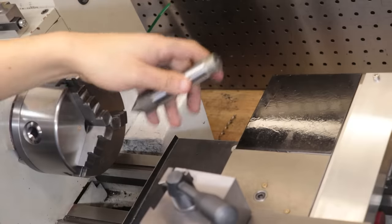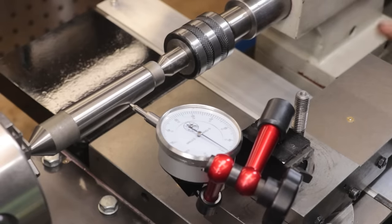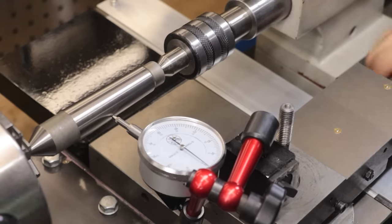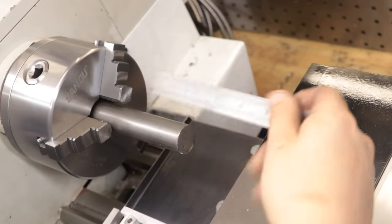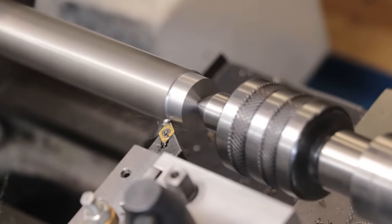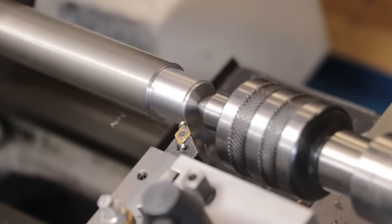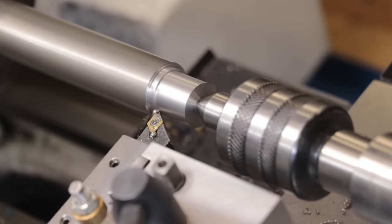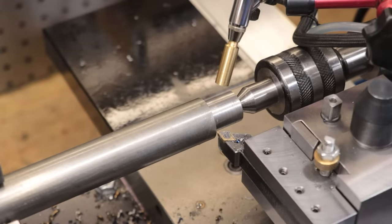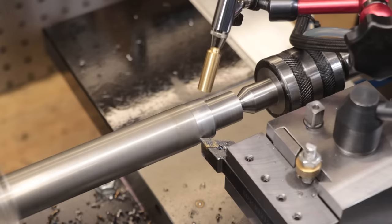Before I get the stock loaded, I'll get the compound set up to cut a number three Morse taper. I've loaded up a dead center and I'll try to copy the taper using a dial indicator — this is probably the most tedious part of making the tap follower. If you're not using a Morse taper, you can skip this and make a straight shank. I'll get the stock loaded in and quickly machine in a back step-down, which just makes the part a bit longer so the tailstock screw can eject the part when fully wound back. I'll set up the spray coolant and turn the taper — it's pretty slow feeding in the compound, and the spray coolant keeps everything nice and cool.